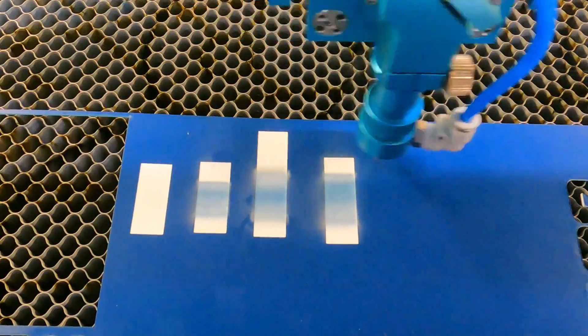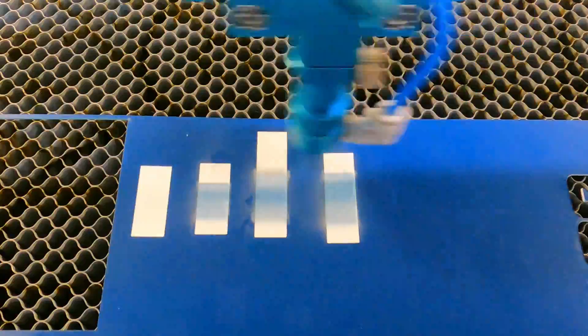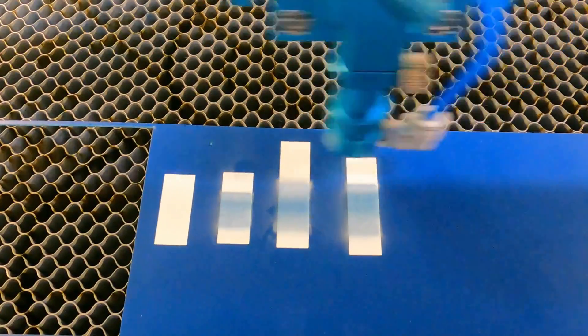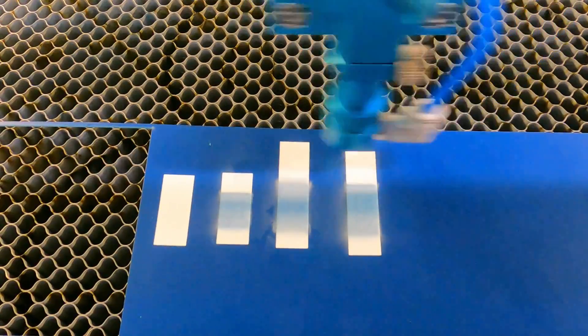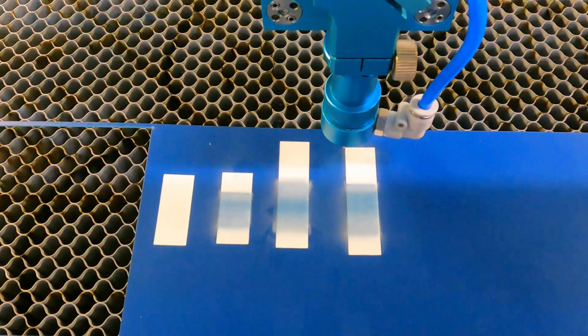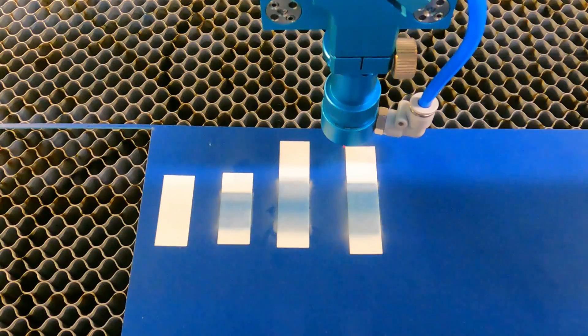And you're going to see we go right back to white. Very predictable. If you've got sign material and you're having trouble with it or just can't seem to get the engrave done, it's probably not your speed and power setting — it's that you have too much air. And even when you go to cut this, you want to have just a whisper of air, because what will happen is it'll take that blue color and wipe it on the sides and you won't have a nice clean white edge. Those are the kind of things that air pressure can do to you.